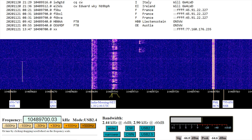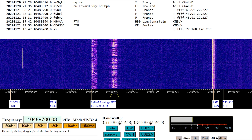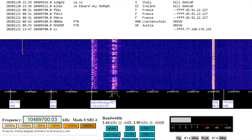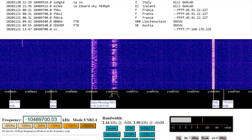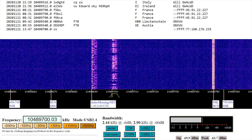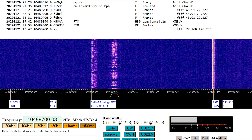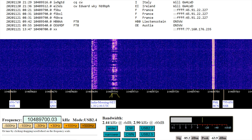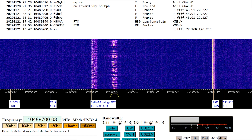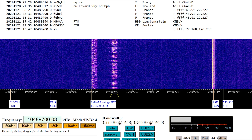So there we go - that's the HS2 being used as an exciter on QO-100, and for me it worked really well. What I really wanted to get out of this test was how well the HS2 remained on frequency with prolonged use. When dealing with transverters and 2.4 GHz SSB, it's really important to have a stable exciter - any slight movement in frequency will be amplified up the chain and could cause audio and reception issues. So for me the HS2 is a great contender as an exciter for QO-100. The DX Patrol up-converter can also take a 28 MHz, 432 MHz, or 1.2 GHz input, though so far I've only tried the 144 MHz.